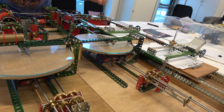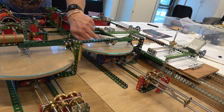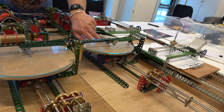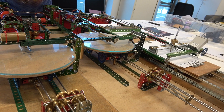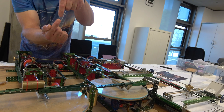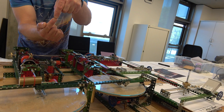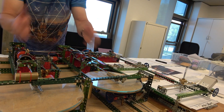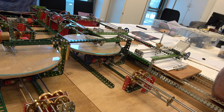So the whole thing really is a trade-off, and where it really matters the most is at the null point. If you have a very thick disc that straddles the null point, then nothing will happen for quite a bit of displacement. But if you had a knife edge, any slight movement of that knife edge would start giving you movement. So that is a trade-off between the thickness of the wheel, the friction, and the amount of error that you're actually generating.